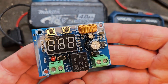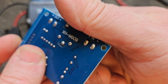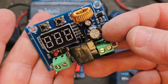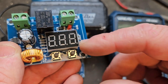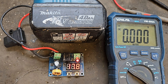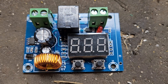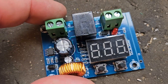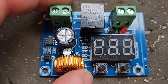Welcome to my channel. Today I'm going to show you how to set up one of these little boards. This is the XH-M609 over-discharge protection board. What this does is provide a cutoff for a battery — a power tool battery, for example — when I use them in Power Wheels so they don't over-discharge. This is single-handedly the most fiddly piece of technology I've ever got my hands on.